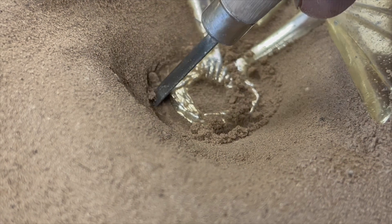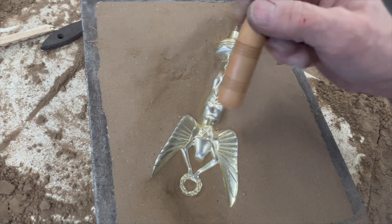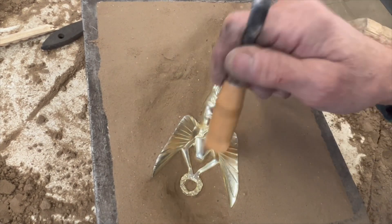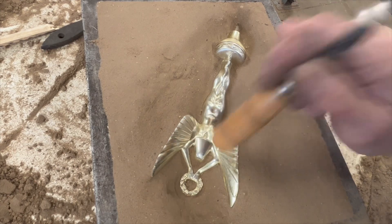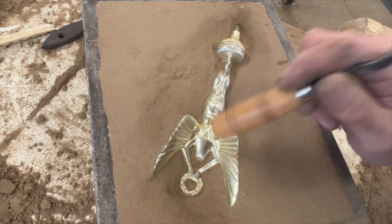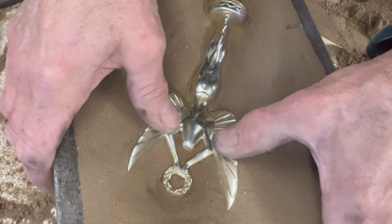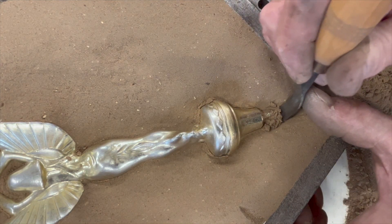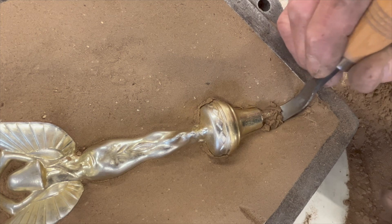It just takes time and patience. This whole carving process probably took me 10 to 15 minutes — it's time consuming but it's also super fun. Now I'm going to tap the pattern to loosen it up just a little bit. If parting lines are too high, the sand will actually start to crack — you'll see it. Around the base there, you can see those little cracks in the sand; that means the parting line is too high. You can see them moving right there, so you just go in and carve that back out a little bit.